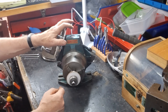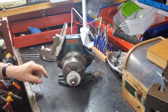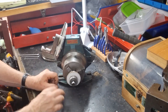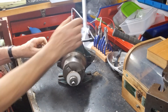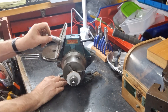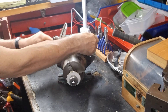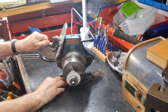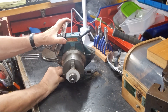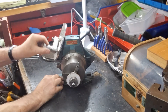This is a universal dividing head. It has graduations around the chuck, which means if you had simple divisions like one to twelve or fractions of that, you can set it into this mode. As you rotate the crank it locks it into place, you take your cut, and then you rotate to the next one. In this case if we were doing twelve teeth, rotate around and there you go - you're in the next position, and so on. And there we have it.